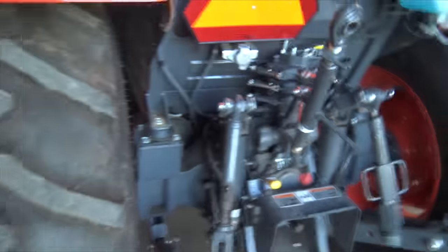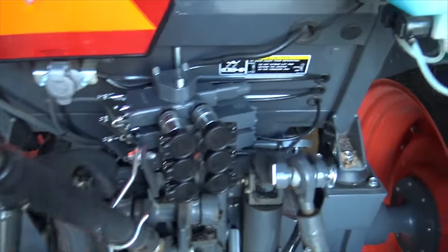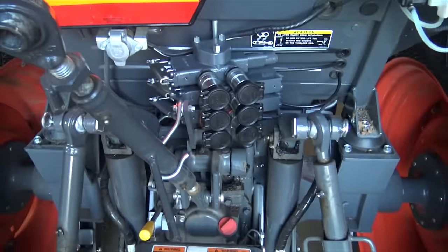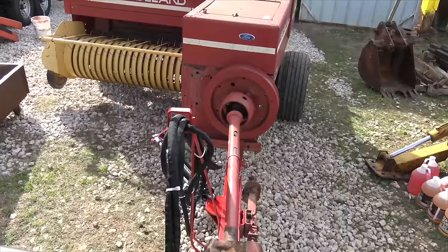In the infinite wisdom of having never done this before, I waited to adjust the cables until after the valve bodies were on the tractor, so I was adjusting way back there with a wrench — hard to fit in, but I still made it work. It would obviously have been easier to do that before mounting. Parts were perfect; I only needed two washers which I probably lost, but everything went together fine. Can't wait to try this out. Thanks for watching — don't forget to rate, comment, and subscribe. Going to do a lot with this tractor this year.